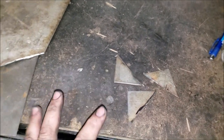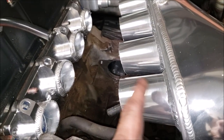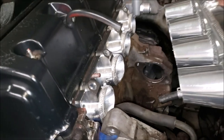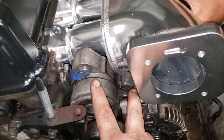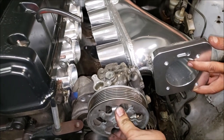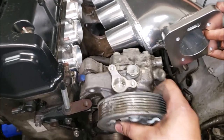While waiting for those to cool, I went ahead and cut our intake manifold. We decided to cut it at the flange - we couldn't decide whether to cut from the tank side or the flange side, so we went with the flange side. The problem is we can't just cut and flip it and put it together - it makes contact with the tensioner and also our power steering pump.